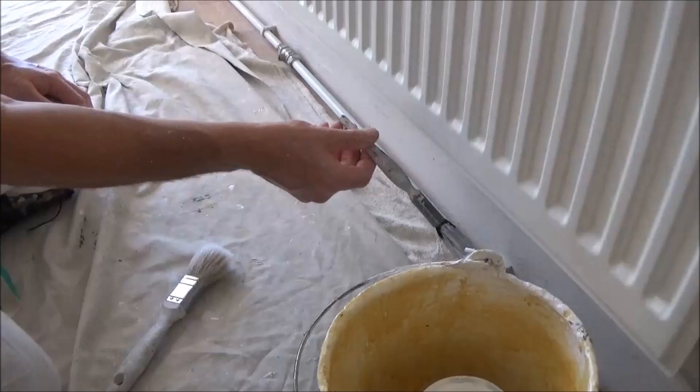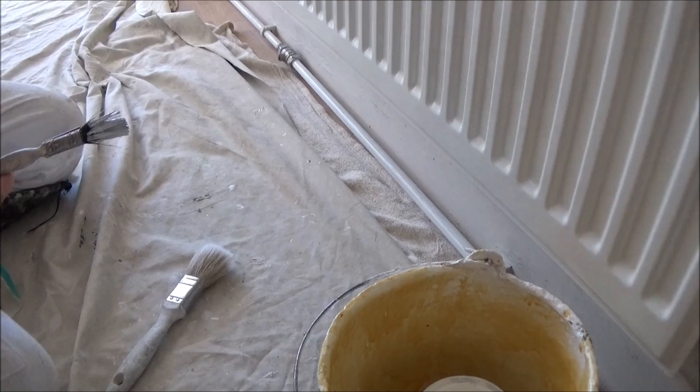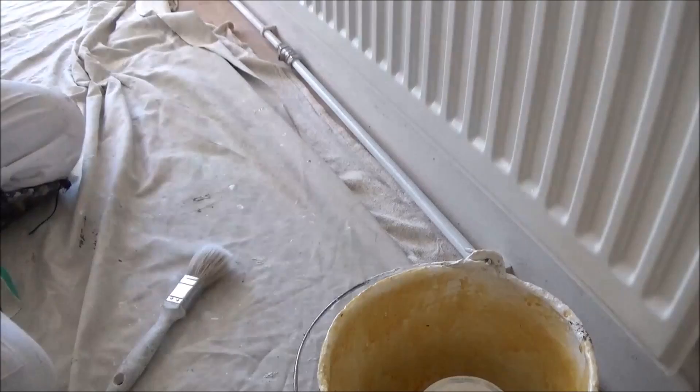Now, it says an hour drying time on the product, but with it being copper pipes it could take a lot longer than an hour. Personally, I like leaving things to the next day because then they are 100% dry and you know for a fact you can put your second coat on without working up the coat underneath. That's it, alright — I'll see you next time.